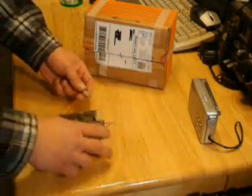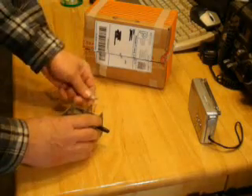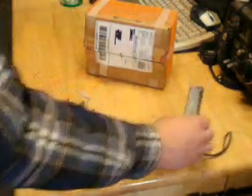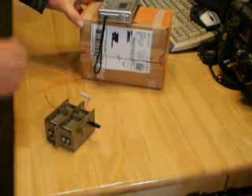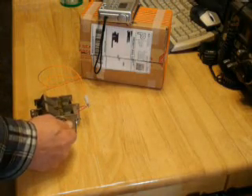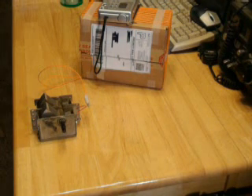If I connect this coil, or inductor, to the variable capacitor, I can tune it to be resonant at any frequency I want. If I tune it to the same frequency that I have the radio set to, it will boost the reception. I've got a usable signal now on the station that I could barely hear at all before.